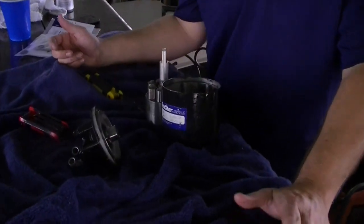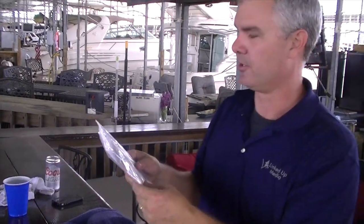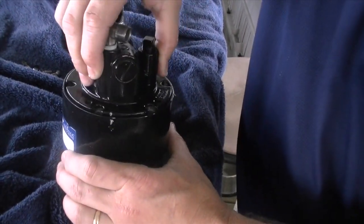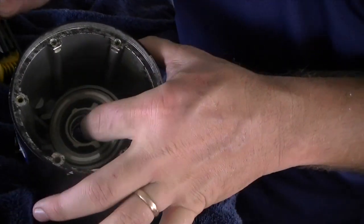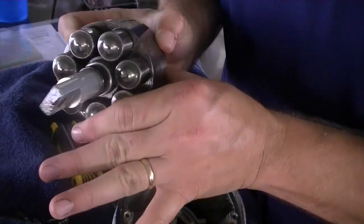You may notice that we now have this thing torn completely apart. What I didn't show you is how we got this out of the helm, but it turns out we need to do a lot more work — the leak was from the rear of the pump. I bought a whole kit so we're going to put all the seals in now to do it right. I put two index marks here on the pump so I know exactly where it lines up. On the inside you can see that this bearing race is actually angled.